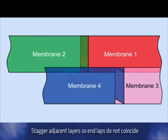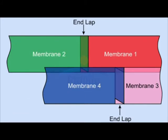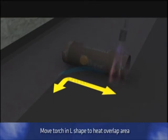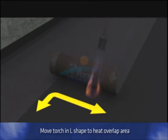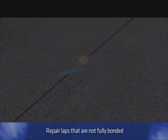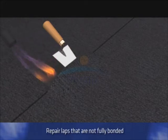Once the entire length of the terrace is covered with the first row, we fix the next row. The rolls in the next row should be staggered so that adjacent end laps do not coincide. Keep an overlap of at least 100 mm for the side lap between adjacent rows of membrane. While heating the membrane, make sure you move the torch flame from side to side in an L shape so that the overlap area of the adjacent membrane is also heated. In the overlap area, press the top membrane and allow a consistent and uninterrupted bead of bitumen to flow from between the lap seam to a distance of 6–8 mm from the membrane edge. To repair laps that are not fully bonded, use a hot round-tipped trowel to lift the top membrane slightly and lightly torch, then press the membrane to join.